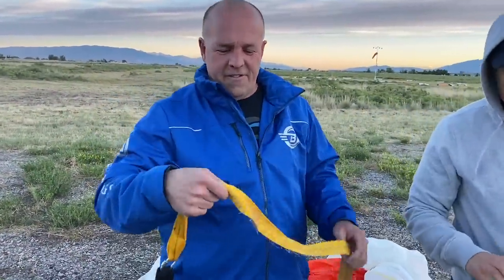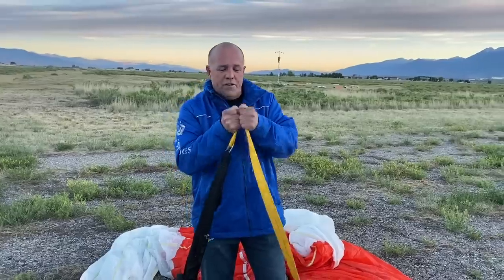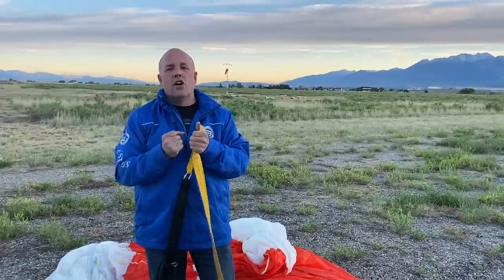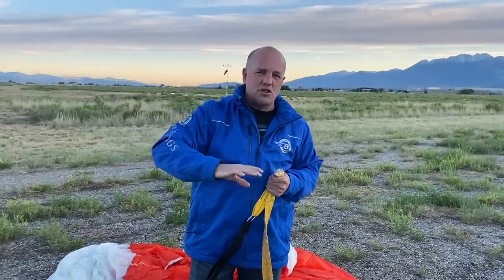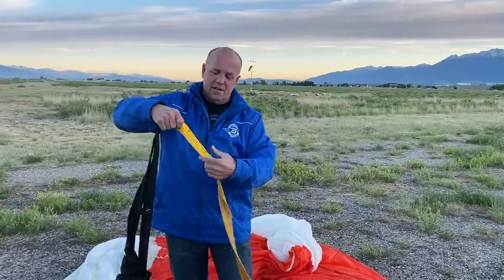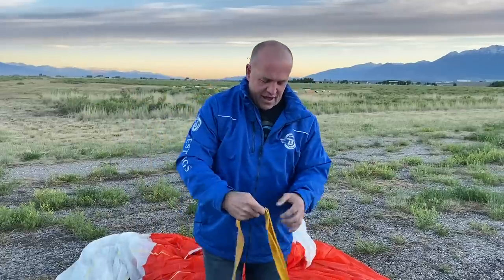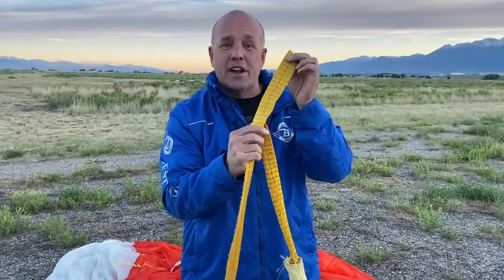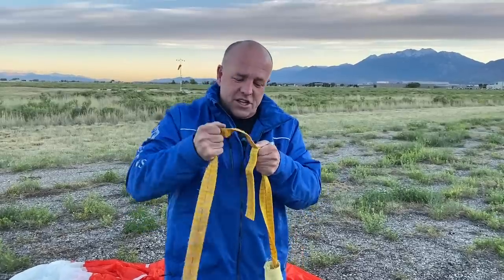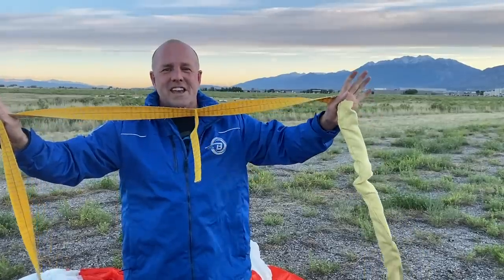So right here, if you look at these, where all the stitching is torn, this is the area where as it pulls, it starts snapping apart and tearing the stitches. And that's what lengthens the rope and slows down the speed of that rocket, which can be anywhere from 200 to 400 kilometers an hour. And then it hits all at once and it would just break everything. So these stitches start snapping and unfolding this all the way out. And you can see it got all the way down to the last few stitches, which is perfect because it left just a little bit. If it went all the way, you might have got a little more stress. So this just kept going until it was nice and even and stopped. So that is so cool. That is a perfect launch.